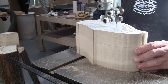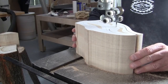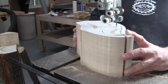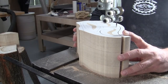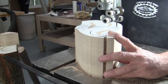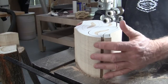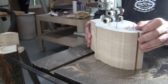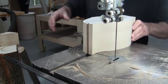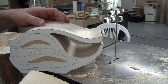I am taking this painfully slowly. I think it's better to go ahead and take your time and leave yourself with fair curves than to leave yourself with a whole bunch of sanding to do later on. Just trying to stay as close to those lines as I possibly can. And that is how the drawers get released.